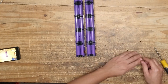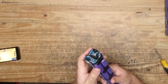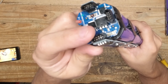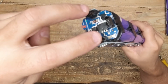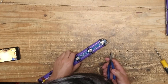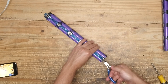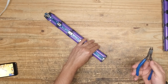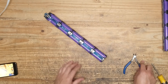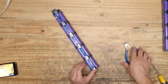For now I'm just going to show you how to take these apart. The next step is to cut these off. If anybody's got a lead on those little connectors, that would be pretty awesome because then you could just connect stuff in there and have access to all the leads. Let's see if we can do this without making too many sparks. Start with the bottom — that's a good idea because as soon as you disconnect this, you cut the pack in half. So now instead of potentially 42 volts in here, it's half of that.